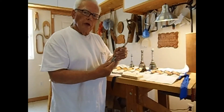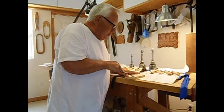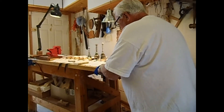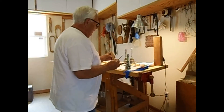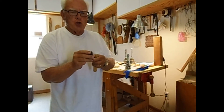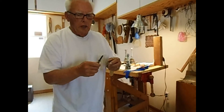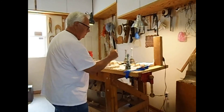This one I've been carving stone with, and I went back and resharpened it to 22 degrees — you can see it's still a good chisel for wood carving. I haven't hurt it at all. When I put this in the vise, the vise is lined with leather so it's not going to hurt it. You can remove the handle and put the wood handle back on. I want to show you what a nice sturdy shank this has — most are thinner and come to a point, but this has good heavy notches to keep the handle from turning. It's a good stiff shank. And it's back to wood carving.